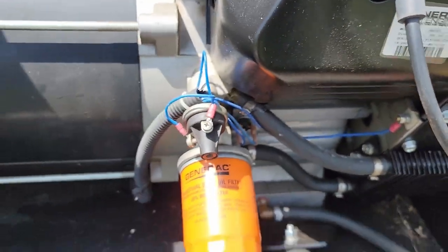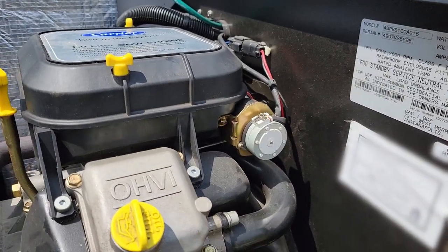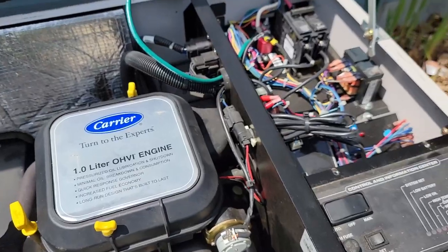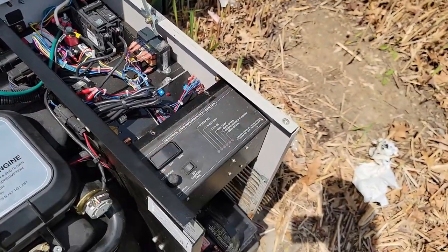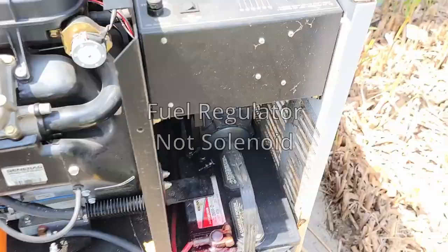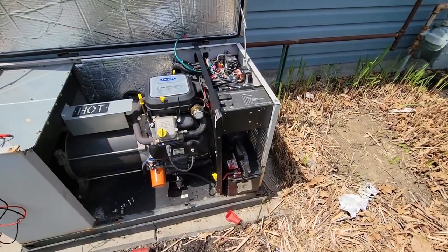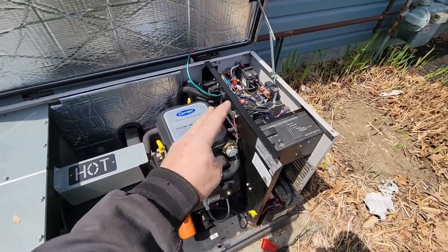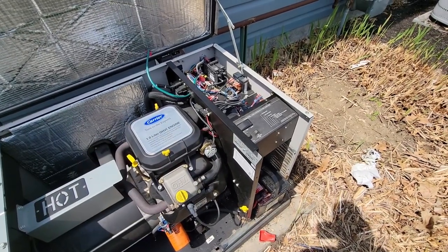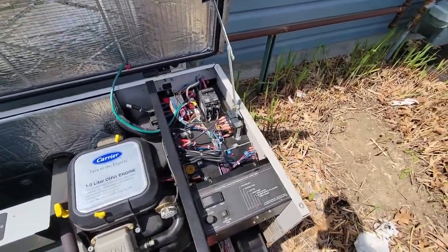There are other safety things in the circuit that can go wrong - you've got the oil pressure safety switch that can go out, and the temperature switch down on the bottom. Some of these are normally closed, some are normally open circuits. You've got your servo here - I haven't had too many of those fail, though I've had idiots leave the cap off and lose the oil everywhere. The fuel regulator failing and that fuel solenoid sticking are some of my main failure points, and that's exactly what happened here. We gave it the two-finger plunge, it came right on and ran, and now that it's loosened up it's working just fine.